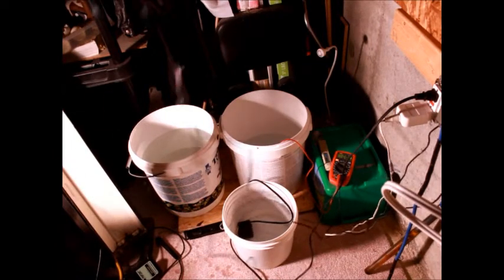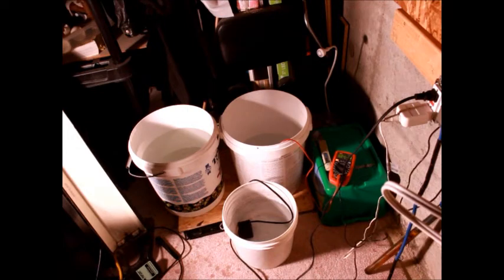I just want to show how a ground probe works with a GFCI and how your tank can actually be live with electricity. If that GFCI is faulty and doesn't do what it just did here, you could be electrocuted. It's better that the ground probe is in there to shut off the equipment before you put your hand in and find out it's not working. Thank you.